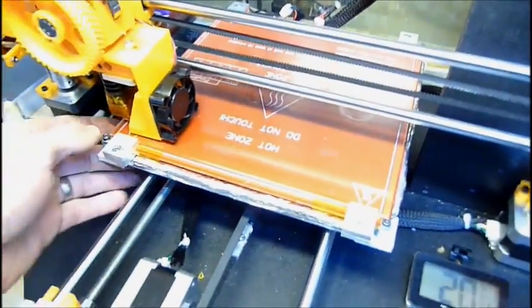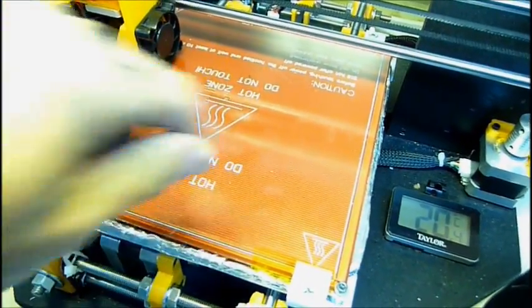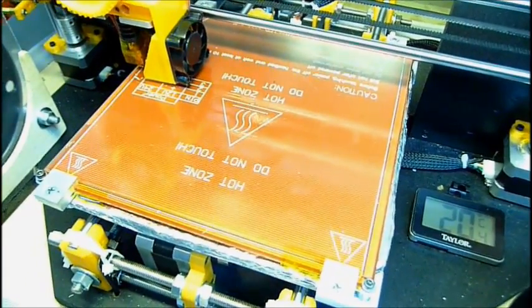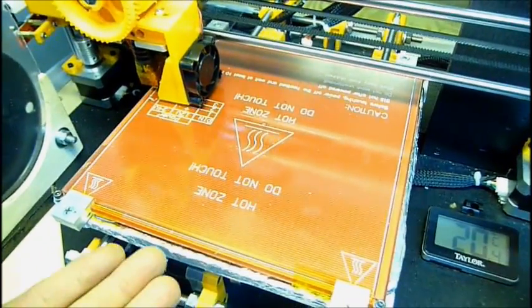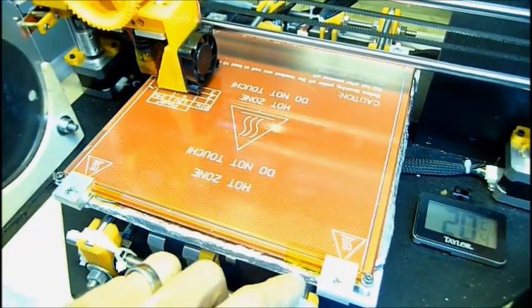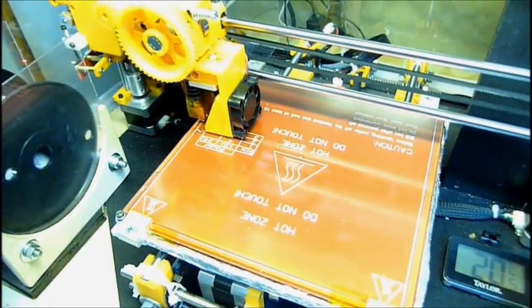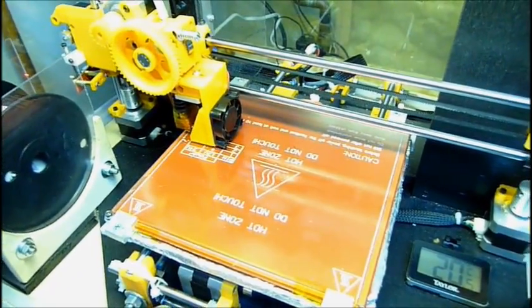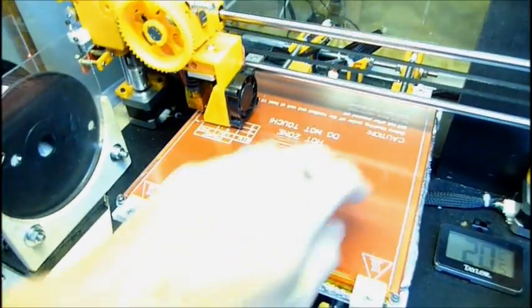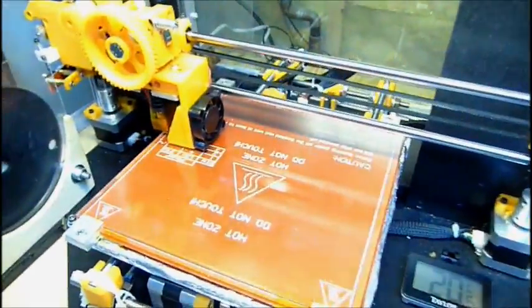What I found was I had the heated bed the wrong way. The traces should be facing up because that's where the heat's coming from — you want the heat to rise up and warm the area above the bed. It was flipped over and heating more underneath the bed, not above. I was having layer separation at higher print heights because the temperature wasn't consistent. So I flipped it over, got some cork, covered it in aluminum foil, and put it between the heated bed and the aluminum build plate, and that worked out really well.